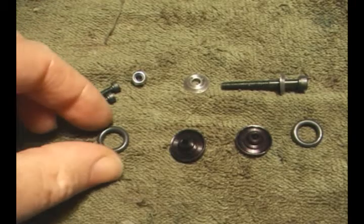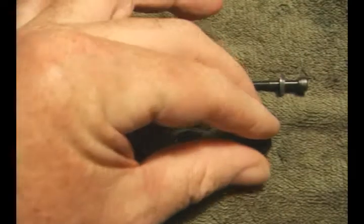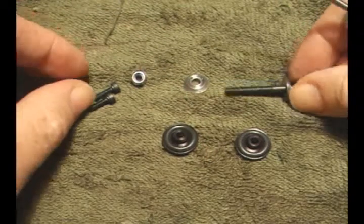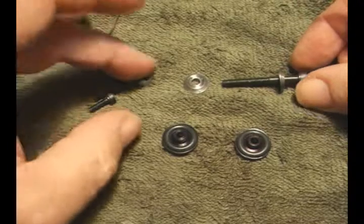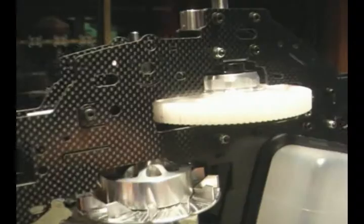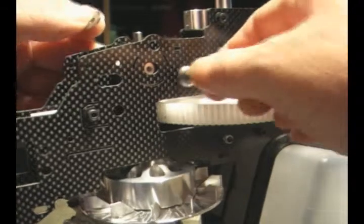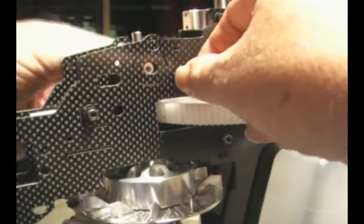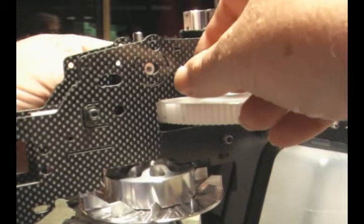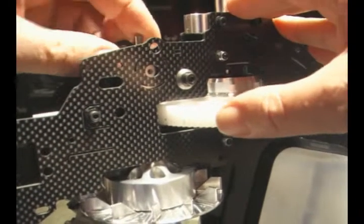Here's the mounting hardware for the clutch mounting block from bag 12-2. Put the O-rings into the damper mountings, and put the special washers on the M4 bolt, and have its M4 lock nut and the 2 M3 bolts ready. First off, the M4 bolt goes through that funny little swivel damper at the rear with its washer, and we can loosely put the lock nut on the back, and this basically gives the mounting block room to slide on this.